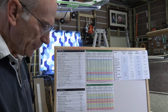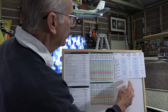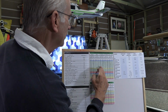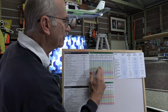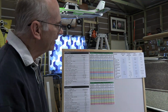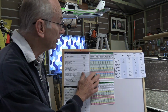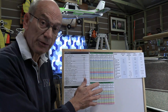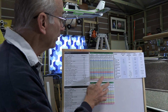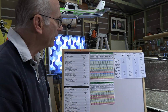But as you look at that, it's interesting that the watts input for the 3,776 is only 877 watts. We were thinking it would have to be something like 1,400 even for the 40 motor. So that's a huge discrepancy as you think about those two. It's really strange. But with Cobra here, they've given us actual test data where they've put the prop on the motor, spun it up and measured the thrust it generates. So I think we can say it's reasonably accurate that it's going to develop that amount of thrust with just that amount of watts.